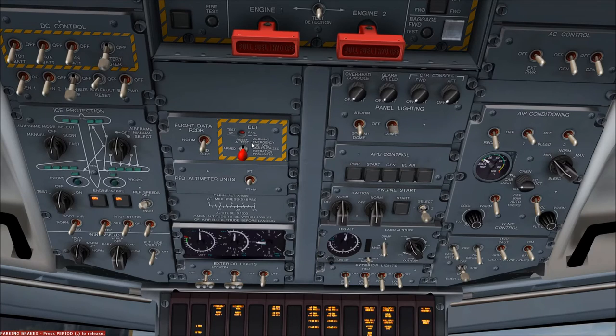Once this is the case, the starter push button can then be depressed and an amber starter light illuminates until the APU fires up to half its operating speed. Once operational, the APU will show a green run light in the power push button, and an amber warn light in the generator push button indicates that the DC generator is not connected but ready for use. Selecting the generator push button connects the APU generator for provision of electrical power and a green on light illuminates.